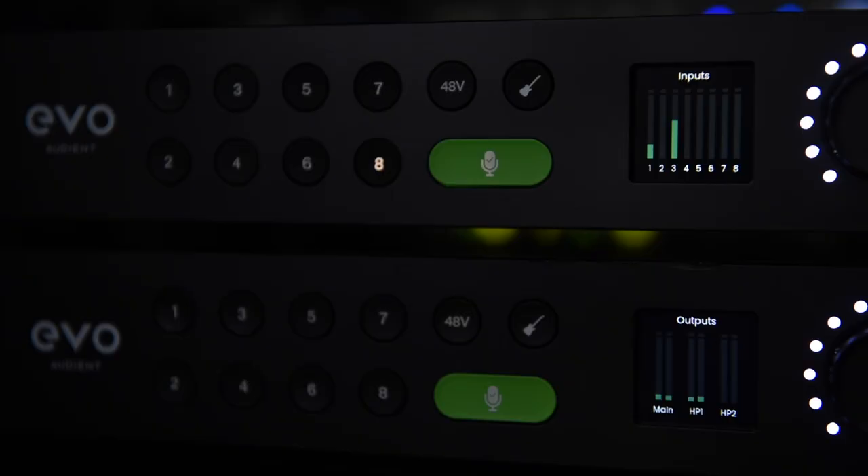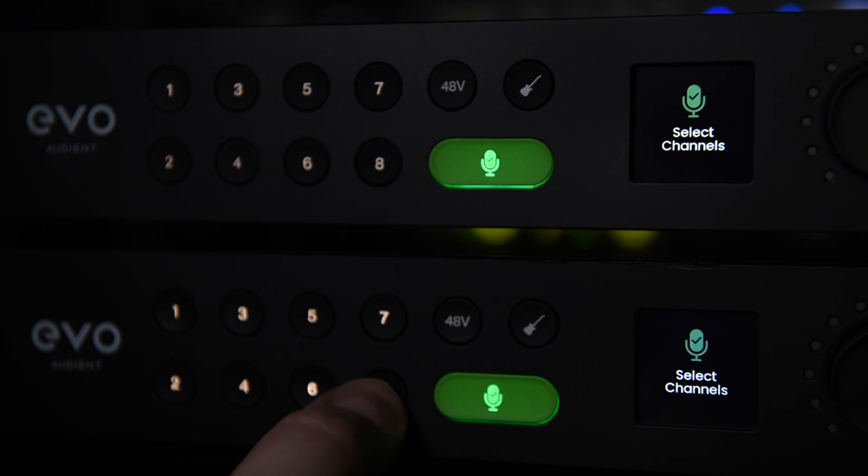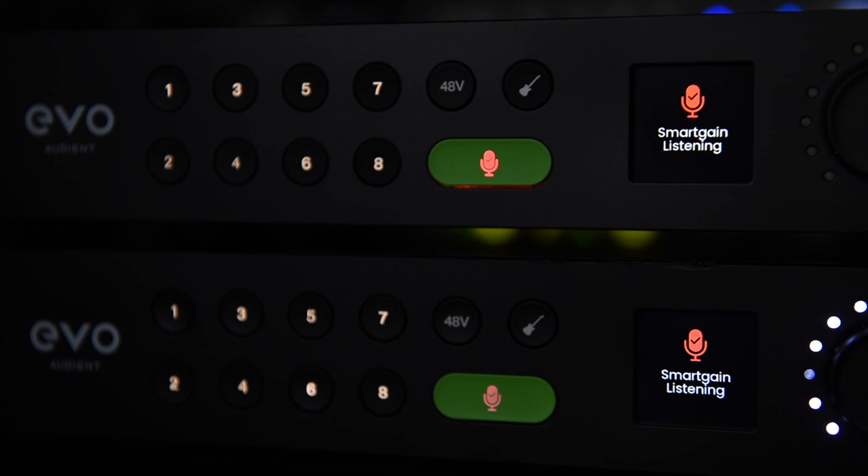There's no way around this, so we don't have a choice. Secondly, to set up the gains, I've utilized smart gain on the SP8, which automatically detects the input signal on each channel and sets the gain to record at an RMS — or average — of minus 18 decibels in your DAW. This is the perfect level for mixing. I've matched the input gains of the ASP880 to the smart gain measurements on the SP8.